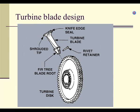When you put in one blade and set another next to it, the blades interconnect at the disc and also interconnect out at the very top, making a ring out of multiple segments. That ring creates an aerodynamic seal. This design gives less pressure loss at the tip, but you have to spin the blade at lower RPM due to more mass at the tip and higher centrifugal force. You might see this on lower-RPM engines like the power turbines of a turboprop.